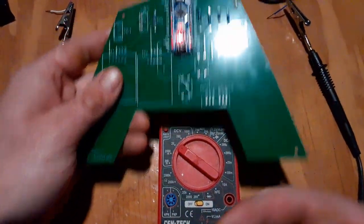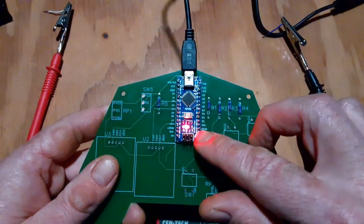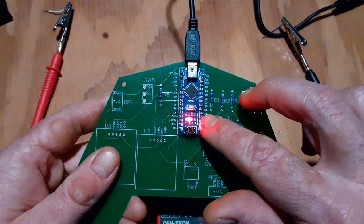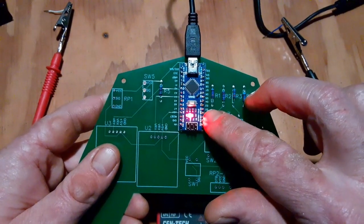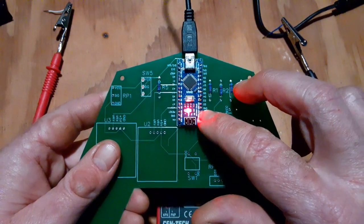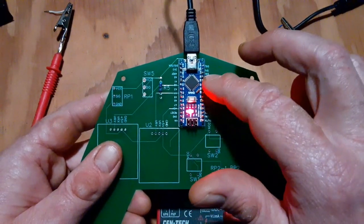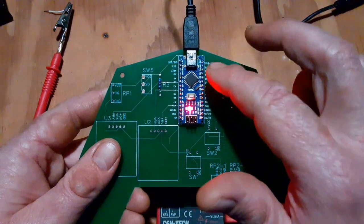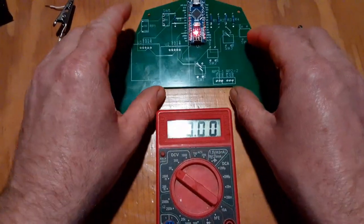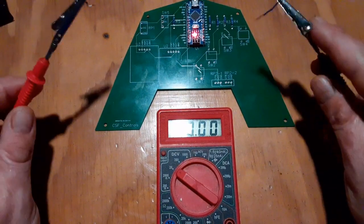The same one the USB port uses. So can't use those two at the same time. So I almost never use those unless there's like a Bluetooth antenna that they're going to or something. And even then, I'll usually try to do a serial reassignment and use one of the other parts for UART communication. So I pretty much never use those pins, but I still want to check it.